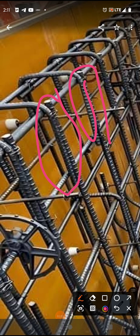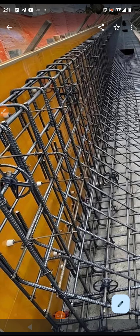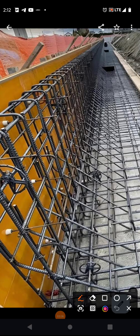Now let's go to the overturning of it. Just think of it as being pushed, just pushing this wall. Don't think of the base yet. If you push this wall to the left, image left, so if I push it this way at the top, it will put these steel members in tension. The backside is the compression members. It'll go in compression, and it's that rebar.